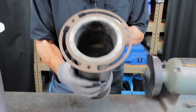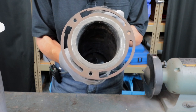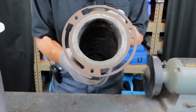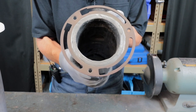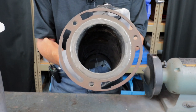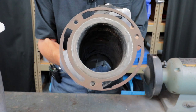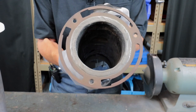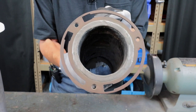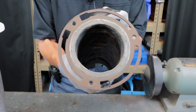First, let me mention this: when I run across a loose toilet that I have to remove and the top of the lead is somewhat questionable but still viable, nine times out of ten I'm going to solder a floor flange on. This is something I wouldn't expect a DIYer or homeowner to do, but that's what I still do — I carry brass floor flanges with me, and that's just the way I roll.